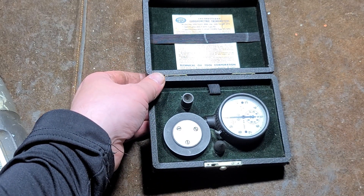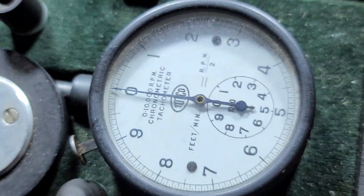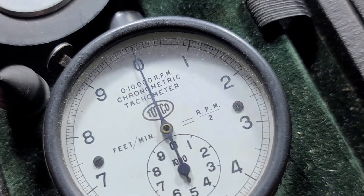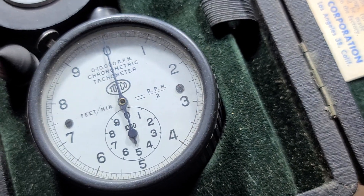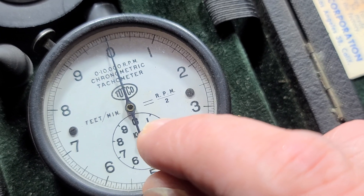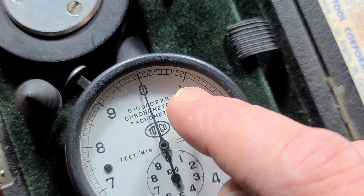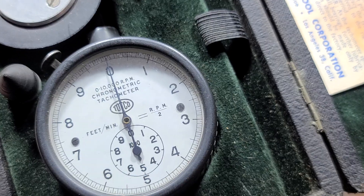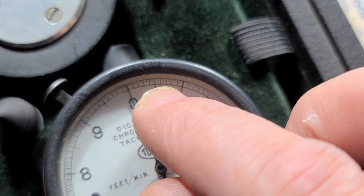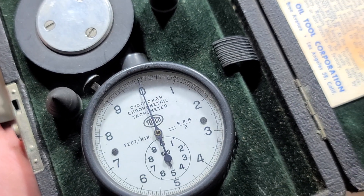Caddis Maximus here, this time with the TOTCO Chronometric Tachometer. What that means is it's a mechanical dial tachometer. This happens to be a model 145, which is a more premium 10,000 RPM unit with two dials. The big dial goes around once, the little dial goes up to one, meaning 1,000 RPM. If the big dial only goes up to the one, that's 100 RPM, and there are 20 divisions, so each major division is 10 RPM and each minor division is 5 RPM — surprisingly good resolution.